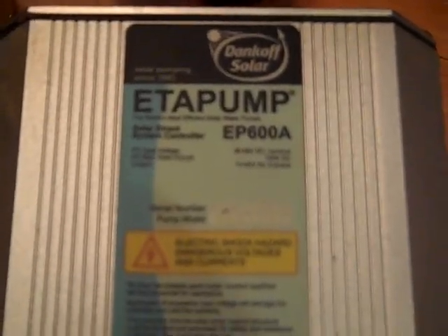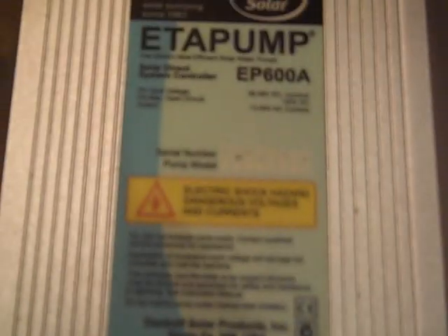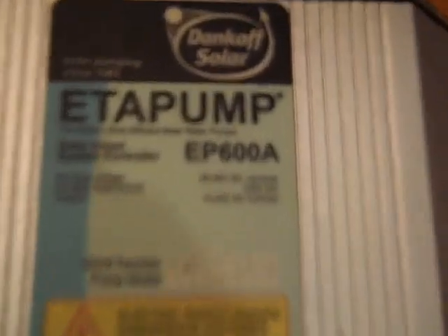Engineer 775 here, wanting to talk about having backups to backups. This is my solar water pump controller — had it for just over six years. It stopped working the other day, and I think it was due to a lightning strike and a windstorm. This tank-full light was on and wouldn't go off. I did some troubleshooting: the solar panel is fine, nothing's going to ground, so I isolated it down to this circuit board. Not what I wanted to find, but at least I found why it's not working.